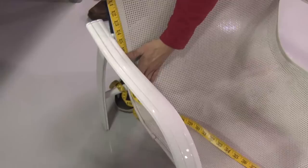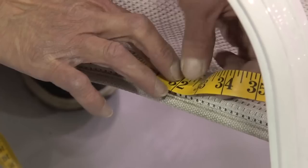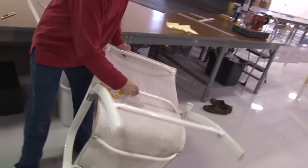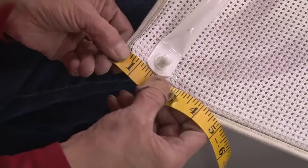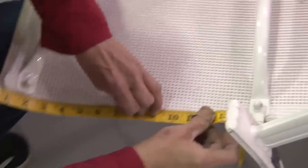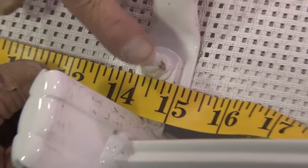Before you disassemble the chair to remove the cover, it's always a good idea to take measurements of the chair as it is now. We're right on the frame, which is what we're wanting. We come into the cover and we're coming out right at 42 also. The next step is measuring for the screw holes. The very top first screw is one and a half. You want to walk that completely on the bar and fabric. We're at 14 and a half.